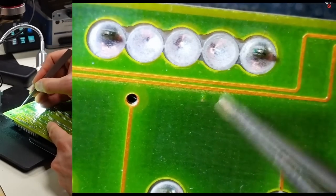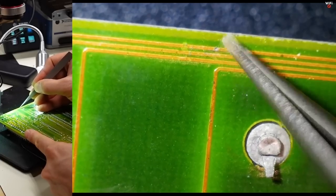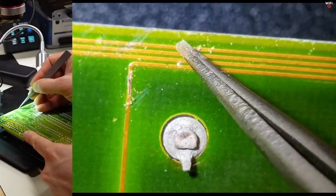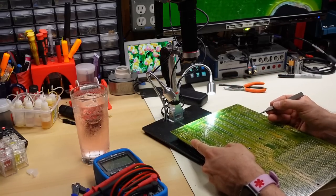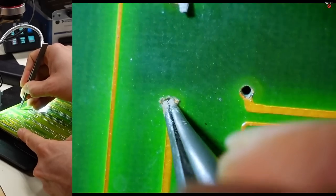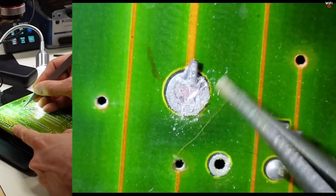Time to survey the underside of the board. There's a tiny bit of corrosion on what is the keyboard connector. I think those traces are not broken — it's just a little bit of corrosion under the solder mask. So it's probably a good idea to try to scrape it away and then paint this with a little bit of UV-curing solder mask — I always just use clear nail polish, which seems to work well. Looking at the battery connections on the underside — that one is extra crust-o-matic.